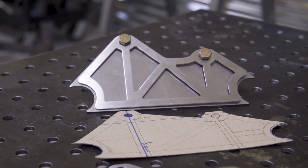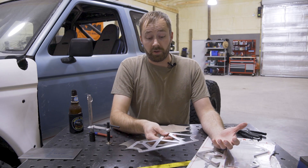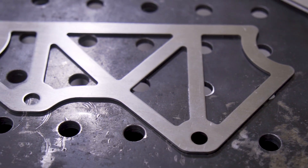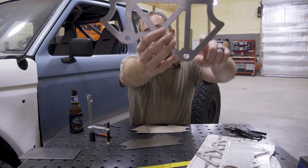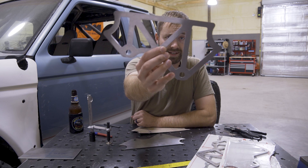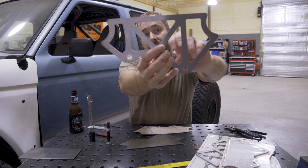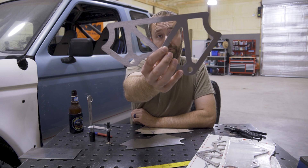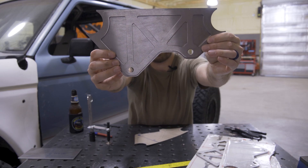It's exactly how I wanted it, but I didn't just stop there. A big part of the reason why I wanted to do this on the computer is to make an overlay plate. This goes right on top and provides a lot of strength but not a lot of weight. It beefs up the bolt holes and I got these cool cutouts that I can weld together. This is not something I would want to cut out by hand — it's doable, but to get all these cutouts and radiuses nice, it would be very time consuming and difficult to make four of them that look exactly the same.